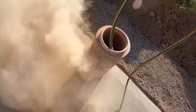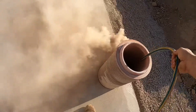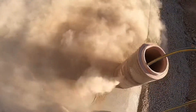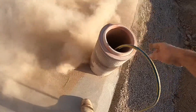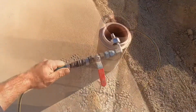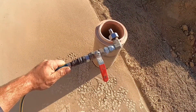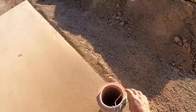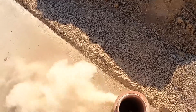Blowing an air filter out isn't hard — you just force the dust off the filter the opposite way it got sucked onto it, and you just keep working it back and forth until eventually there's no dust left. That's the blower I'm using — I usually use it to hook up to air tanks but it also works well for blowing air filters.